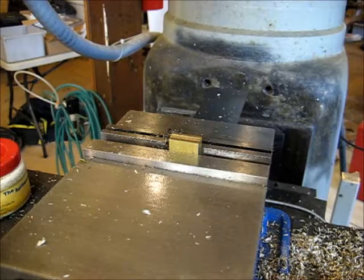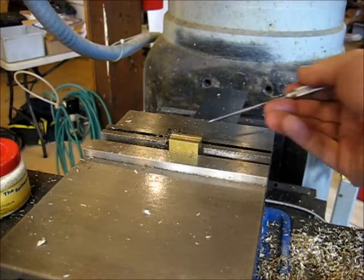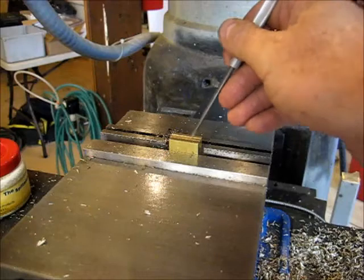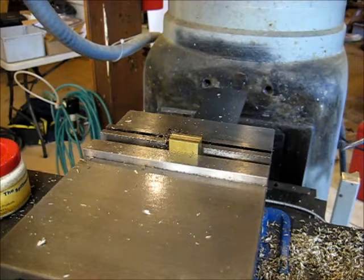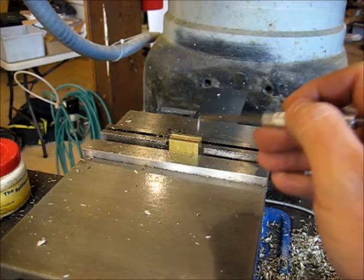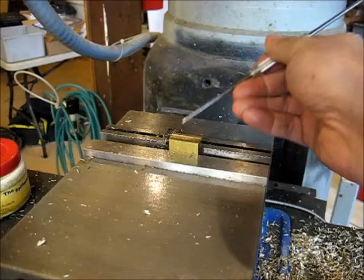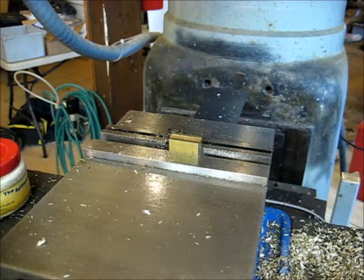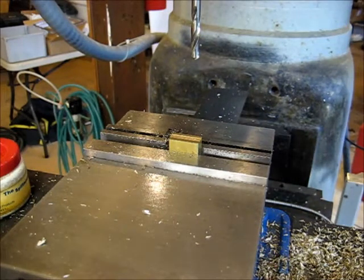So I've got the block back in, did the other large features. I've flipped it over, the red side still to the back. Now we're going to do the 1/8 inch hole in from the other side, the other end, in a 1/2 inch, down towards the Q hole. Eagle-eyed observers will point out, yeah, but we did the Q hole back here. If you flip it over, it's now over here. Yeah, you're right. No biggie. So we were 275 from this end. Okay. We're still spacing off of this end. We've got an inch of total width here. All right. We've got the Q size features.